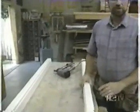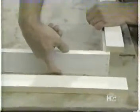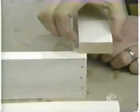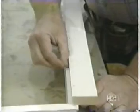The door frame and jamb is made from a piece of 1x6. First I ripped a strip 2 3/4 inches wide for the jamb and connected it with a butt joint at the corner. The exterior casings are 2 inches wide and I reveal them back about 1/4 inch. The head casing is also 2 inches wide, and I'm going to let the ends stick by 3/8 on each end.